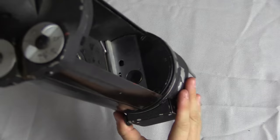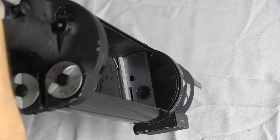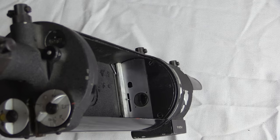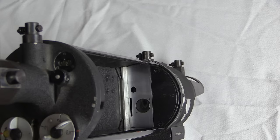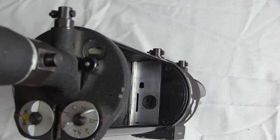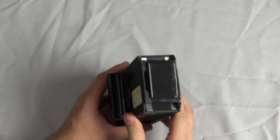I don't know if we'll be able to see it, but we'll give it a try. This is where we're actually getting images through onto the film. And as I rotate the spindle — there we go — you can see the shutter open and it takes a picture. We have an arm right here that grabs the film and advances it forward. It then disappears back into its housing, moves back up, pulls another frame down, and repeats that process as long as the gun is firing.